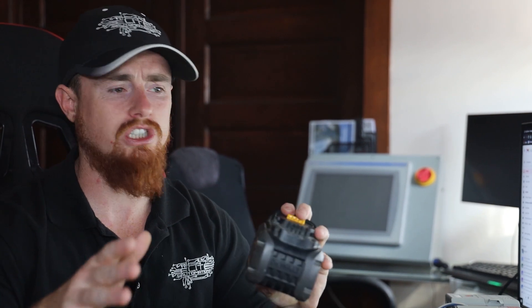That way there are zero voltages above 24 volts, which in a factory shop setting is super safe. That's actually one of the things we try to do with our systems anyway. Whenever we design a system, we try to design everything that's not 24 volts on the other side of the cabinet, so that when you open this side of the cabinet, it's essentially the safest it can potentially be.